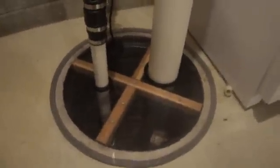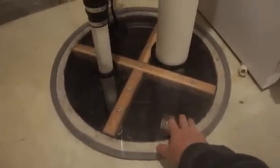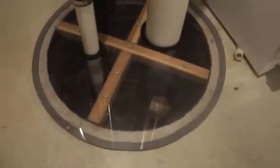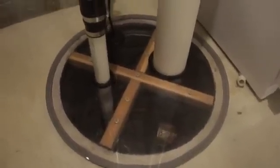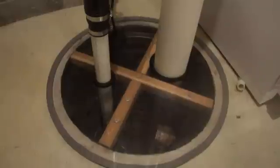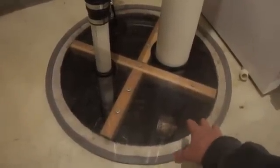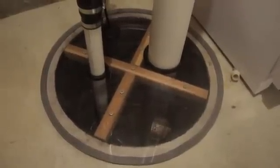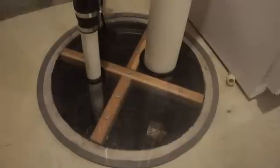Let me go through the components I put in to make this all happen. Here is our sump pump crock — you can see the pipe inside it, which is where any water in your foundation is funneled to and then gets pumped out. The beauty of this system is I was able to use the existing sump pump and drainage pipe to withdraw the radon gas from under my foundation. If you've got a sump pump crock, you'll be able to do the same thing and it'll make it a lot easier to put in.